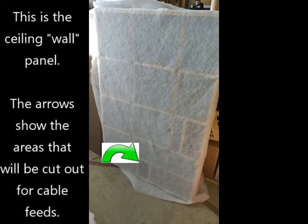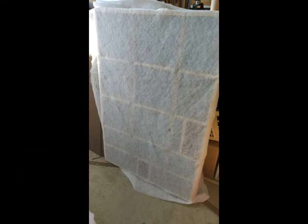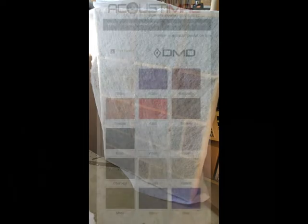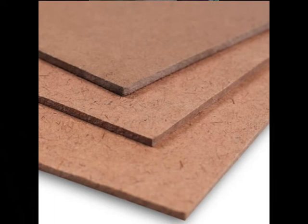I covered the acoustic material and the strapping with a thin polyester fiber fill — anybody who's ever worked with fabrics or quilting knows it's just a thin, fluffy polyester fabric — because I wanted to cover up any bumps or unevenness on the inside walls. The inside walls eventually got covered with an acoustically transparent fabric, again from Acoustamac — the kind of thing you'd use for a speaker grill. On the outside walls, outside of the DB3 mass-loaded vinyl, is eighth-inch masonite or hardboard. It's thin but very dense and very hard for sound waves to vibrate, so it really does help cut down on outside noise.